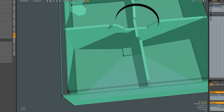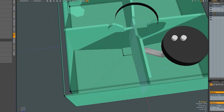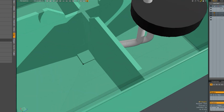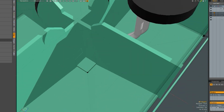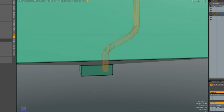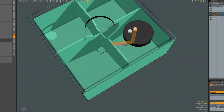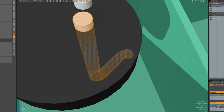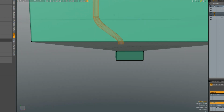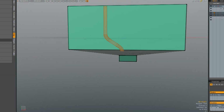And if we turn on the other portion again here, let's move the access hatch. Okay, so you can see that here the fuel lines have two intakes. One of them goes to the bottom, I'll highlight it. One of them goes to the bottom of the sump down here, and the other one, this one, only comes down to the top of the sump, so slightly above it. And the idea is this is the main pickup for fuel most of the time. And so as you're using your tank, it's pulling from here. It's not pulling down into the sump where the debris and water are collecting.